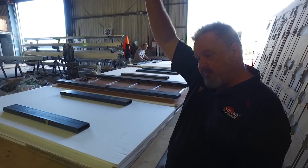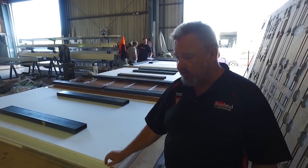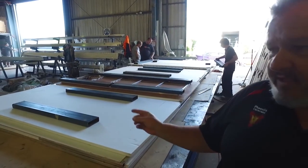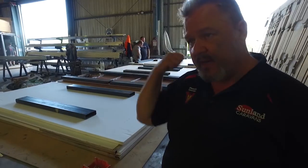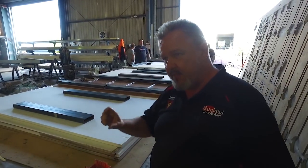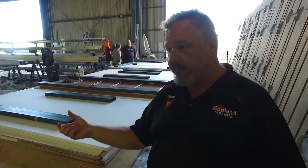This doesn't matter whether the weight's coming from this angle, from that angle, from that angle — it's always going to stay in one solid piece. Absolutely brilliant stuff. Those walls, however, and I'll show you a little later when we go to the other side — we use different sized aluminium for different parts of the structure. So we're using 25x25, we also use a 50x25, and in some cases we can go as far as 75 or even two lots of 50 when producing those parts.